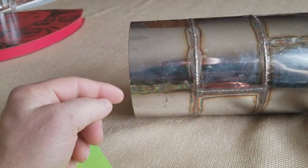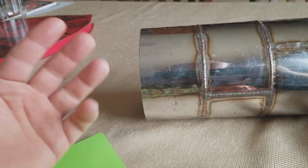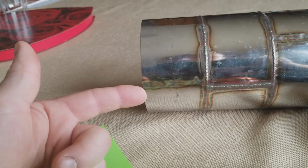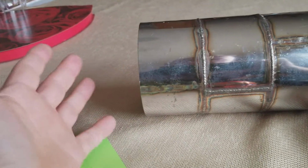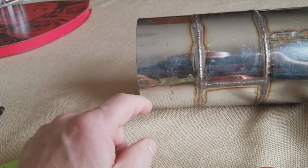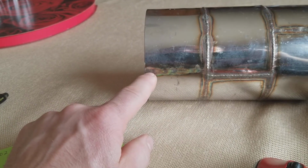So basically, to know what your Z is, you have to know the length of your probe, or whatever you're using. You could use a drill of known length or whatever tool of known length, plus any W of your quill and the Z position. So add up all of those points. If you have no W, obviously it's 0 on the W. So tool plus machine position. Make sure you have it back in machine position, and calculate those numbers down of what that Z is.